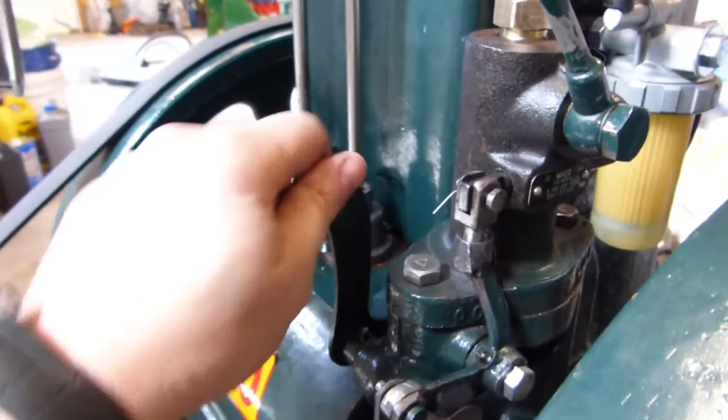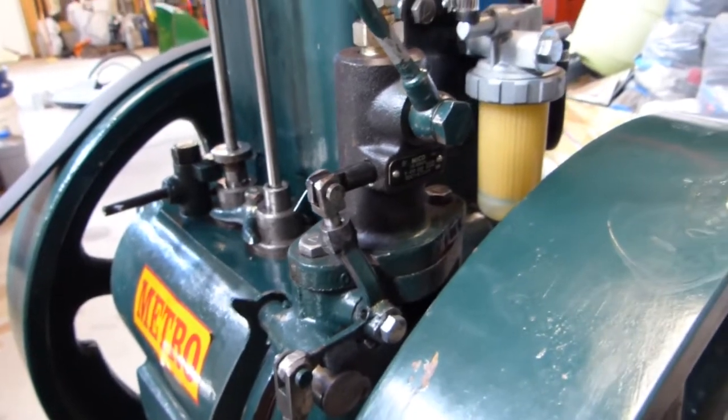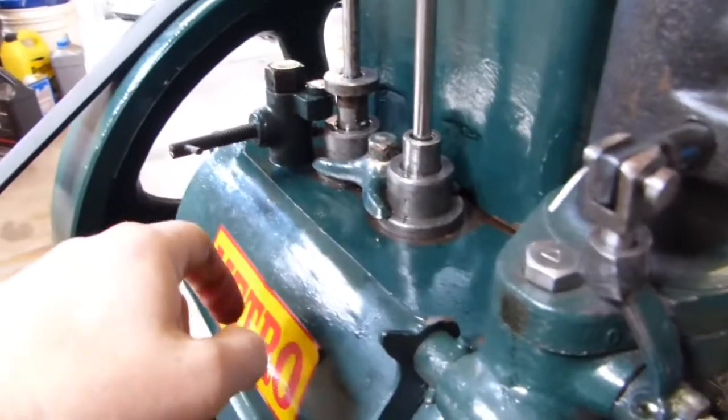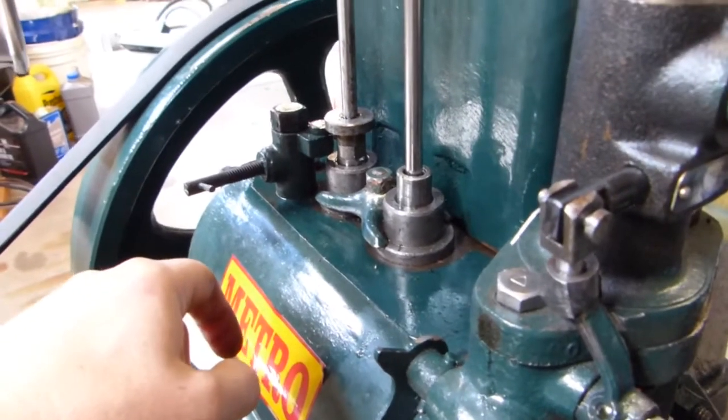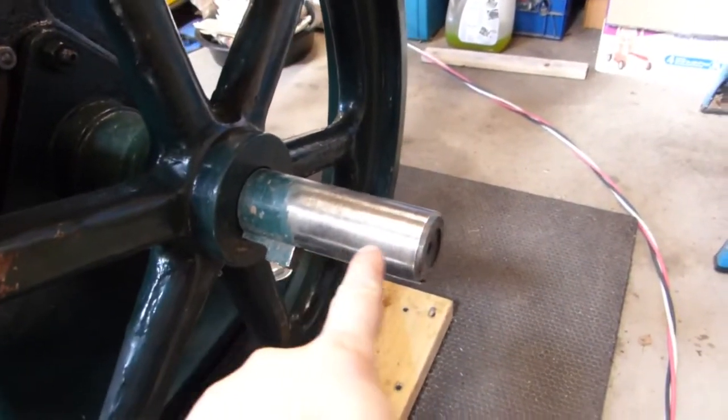So what you do is you put the crank on it, you get it cranking over under no compression, then you flip this down and listen for the fuel pressure to build up. You'll actually hear a distinct clink as the poppet valves open once fuel pressure builds. Once you start hearing that clink, you keep cranking, and then you whip this decompress lever over. If all goes well, the very next compression stroke, it will have fuel and compression, and it'll fire on its own. Then you just slowly walk the crank off of this, and you're good to go.